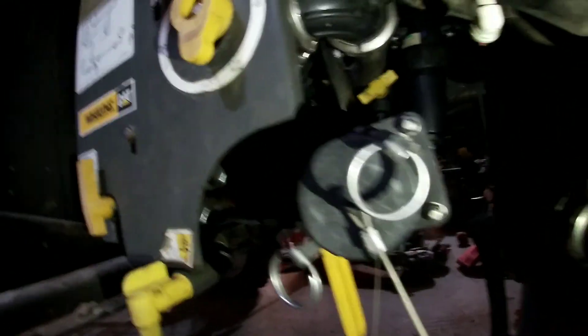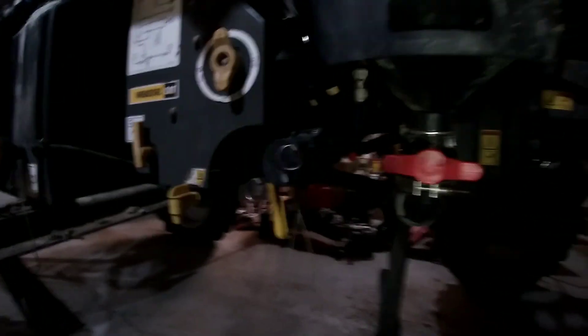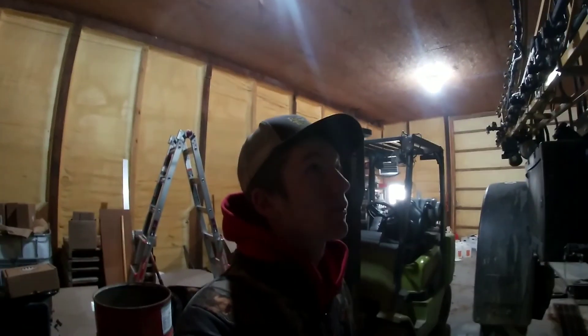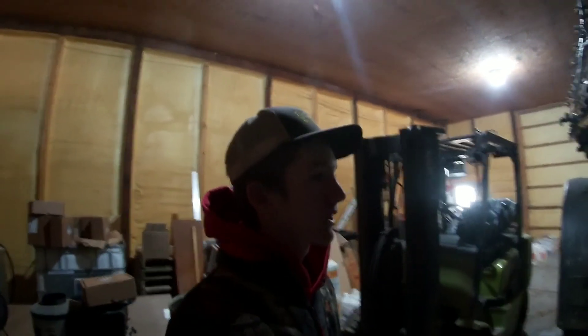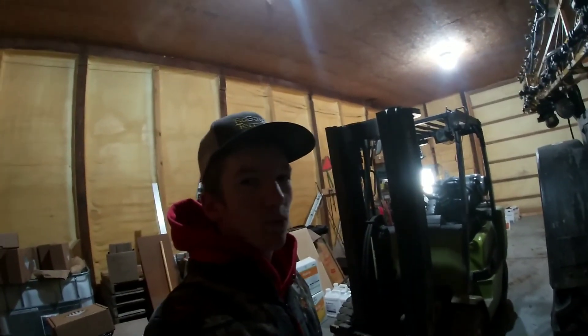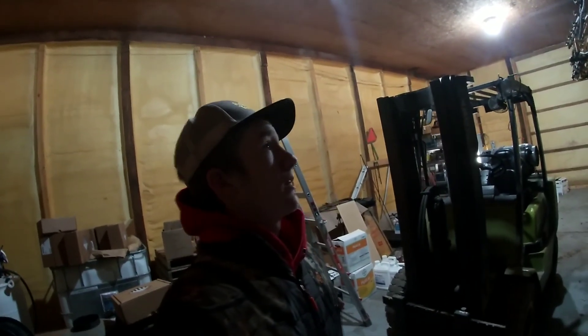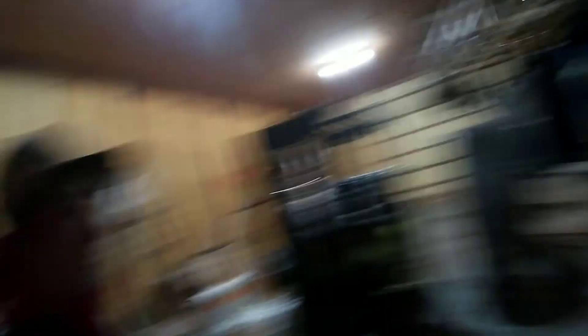It's sure a lot better working out of the wind. This pump had an issue with leaking on a brass valve — I'm pretty sure it feeds the pump. It was corroded out because the person before us never flushed it out really well, or ran really corrosive stuff through it. Now it's leaking on the bottom, so that pump's pretty much wore out and we're going to have to get it replaced. We're going to be selling our pull-behind sprayer — it's a Fastrac 80-foot boom — and we'll just buy a new pump.